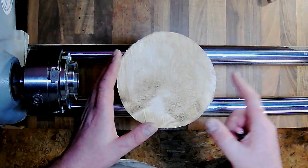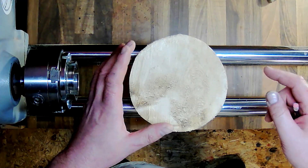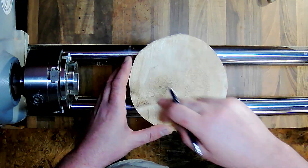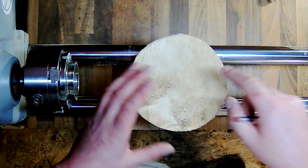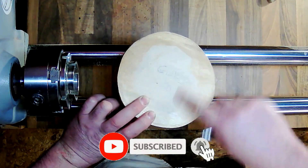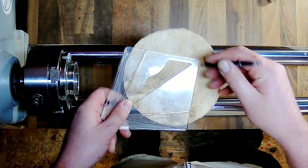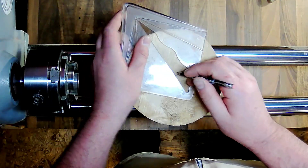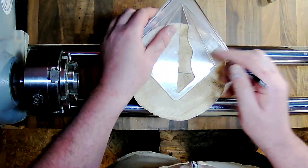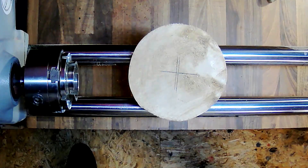I've got a piece here just over six and a half inches across by just over three and a quarter inches deep. This is a really rough piece, so I'm going to use this as my top and hog all of this out as our finished piece. We've got a nice bottom with a nice bit of grain, so we'll use that as the bottom. I'm going to center this with our center finder and then get a forstner bit through the center to give us a holding, and we'll get it in the lathe.